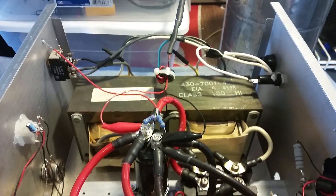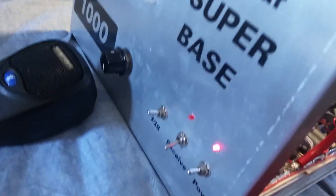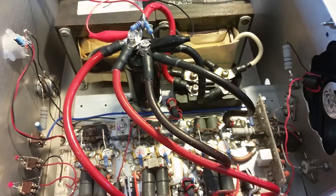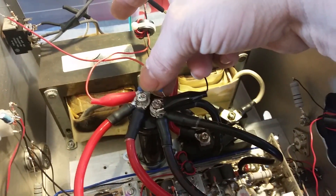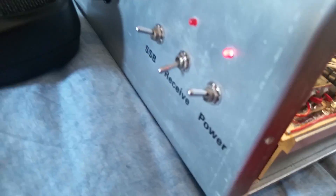There she is, working well. Got you all fixed up — new fan, new variable, the whole new rectification and filter system. I'm going to go ahead and hook this little light right here back up. Whoever put that there — I'll hook that back up, and it's also working as a bleeder resistor to bleed this cap all the way down.